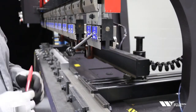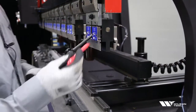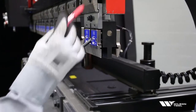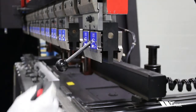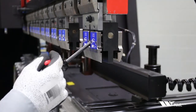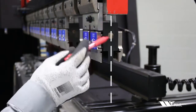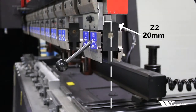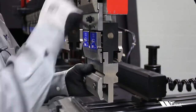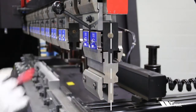Now let's look at what detail makes a Z1 versus a Z2 centerline. As you look at this, you see the press brake and a punch holder. The punch holder in the press brake — traditionally on an Amada press brake — would be Z2. Other press brakes may not be, so don't assume you have a Z2 upper beam. It's easy to tell though: from the centerline of this punch holder to the inside of the tang is 20 millimeters. When I stacked that punch holder underneath, you can see the centerline stayed nice and straight.